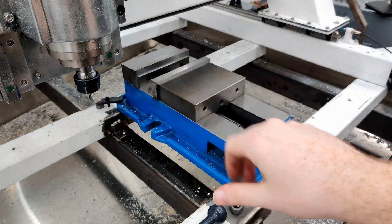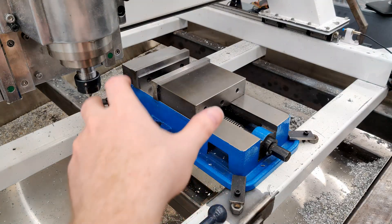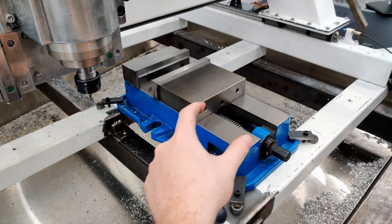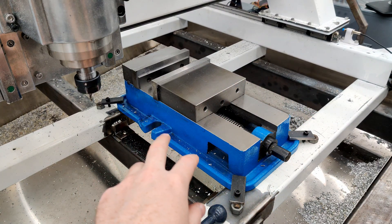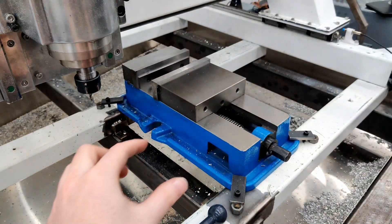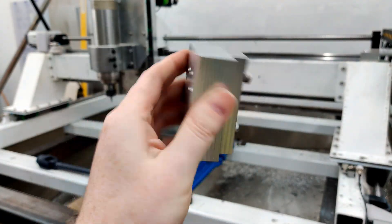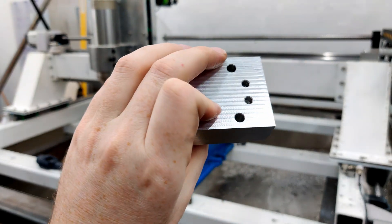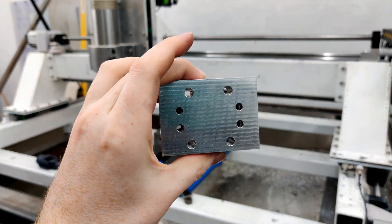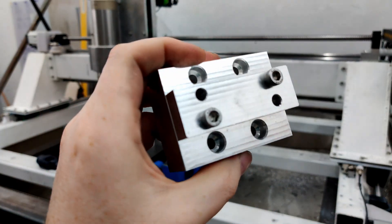This vise — I never intended to mount it like this for so long, and I'd be surprised if it didn't move at all with all the cutting. I might go with my original idea of rotating it, dropping it onto the frame, welding two tubes along it, and drilling into them with machine nuts for a much more permanent solution. Those last two drilling videos are also kind of like Cunningham's Law in the wild — they'll probably attract lots of good comments on peck drilling. That's it for this video, see you in the next one.